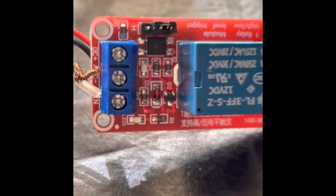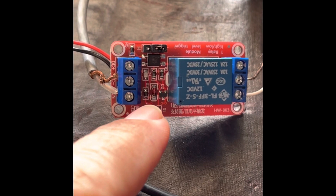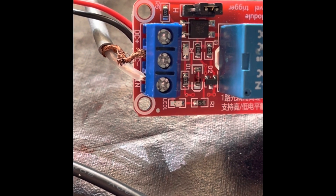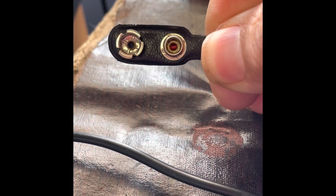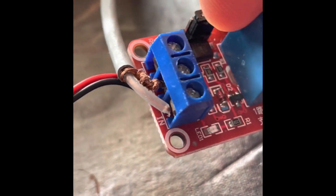What you've basically done is connected an RCA cable with the relay in the middle. The last thing you need to do is supply power to the relay — that's where the black and red wires come in. The red wire goes to DC-in, and the black wire goes to the same location as the shield of the cable, a common ground, so you can connect both together. I'm using a 9-volt battery with a battery terminal soldered onto the backside of the circuit board for portability, but you could also use the screw terminals.